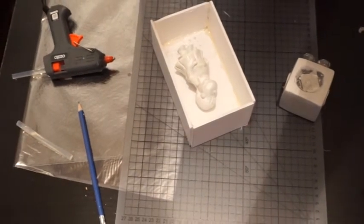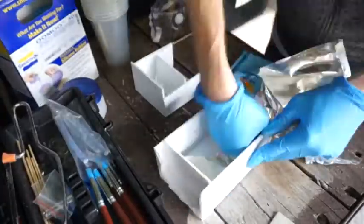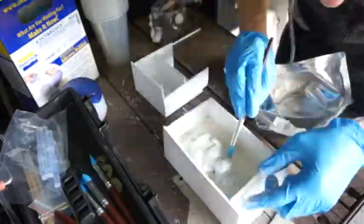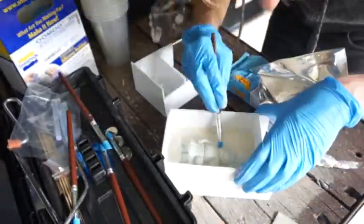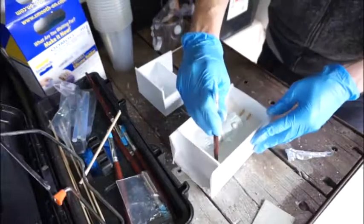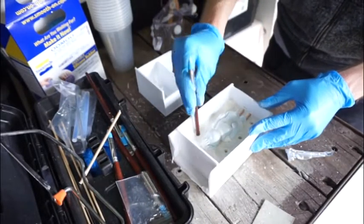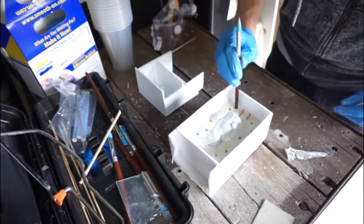I'm filling the bottom part of the mold with clay and making sure it's all nice and flush against Quendi, who's about halfway sunk into that clay — making sure it's all nice and smooth and as flat as I can. It's not perfect as this is my first attempt. I think next time I'll spend a little more time on that. I'm also doing some registration marks so that when I have two parts of the mold, there'll be little teeth to make it fit together almost like a Lego block, nice and snug.